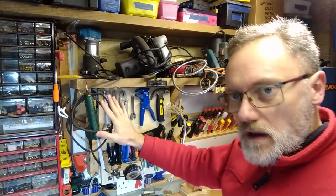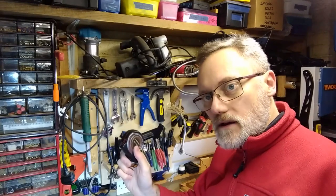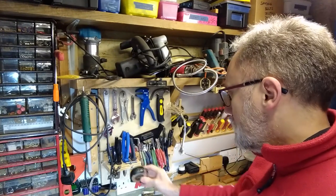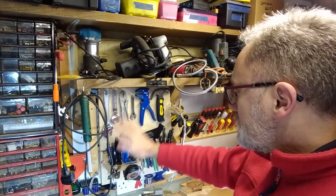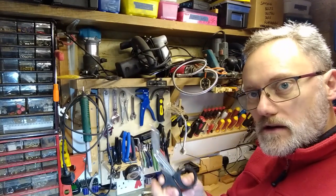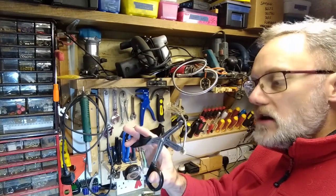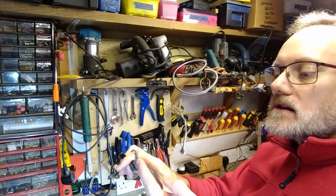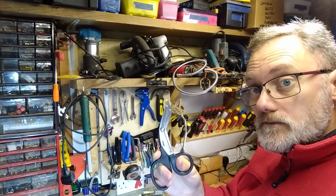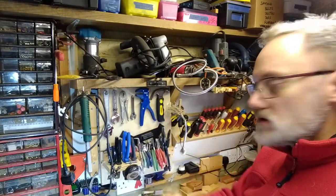Another tool board, though I need to improve it because the cable tends to get behind my tape measure, which I need to replace this year — it's just not in as good condition as it should be. Pliers, cutters, smaller pliers and cutters. If you don't know about these — paramedic EMT shears, also called trauma shears — great for cutting a variety of materials. They don't leave a really clean edge because they work on a serrated system, but they'll cut through a penny fairly easily and they're really quite cheap — about five or six pounds, seven or eight dollars.